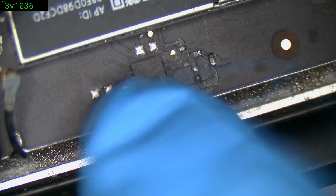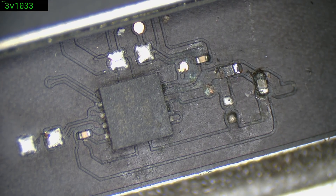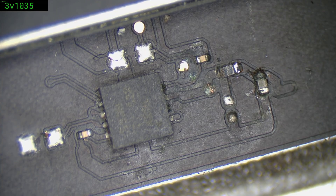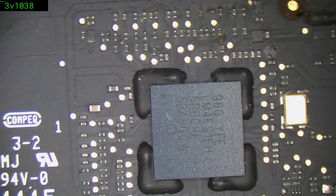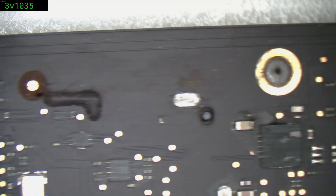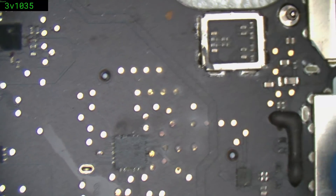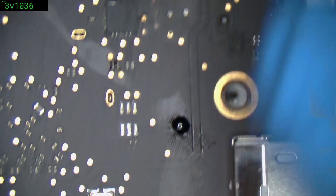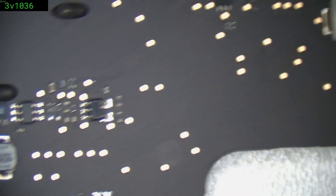Okay, yeah, we've got corrosion here, so there's probably going to be corrosion on the other side around the SMC area. And that's actually pretty nasty — it's really eaten into the board. Alright, let's get the board out. Yep, a fair bit of junk around the SMC. It doesn't look like it made it to the SMC, but there's certainly enough. And that's bad news. Backlight is also messed up — what the heck? That's missing. That should not be missing.